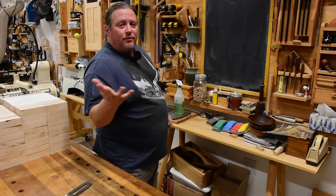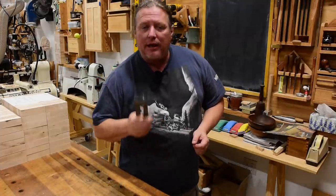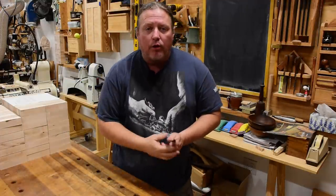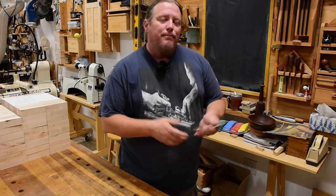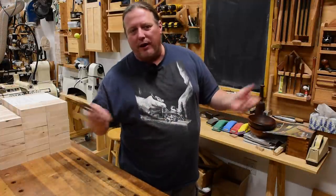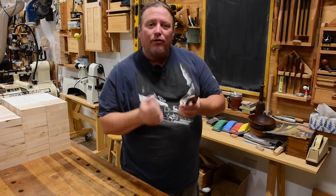So we've now covered my reasoning why I believe adding a camber to your bench plane blades really is a cure-all for at least all the frustrations I was having with hand planes. It's not that hard to do — be it extreme camber, which you first create on a grinder, or something you just do on the sharpening stones over time. In my opinion, it really is a cure-all for a lot of hand plane woes. I hope you enjoyed this and got a few tricks from this rerun, but in the end I always want you to remember that it's worth the effort to learn new stuff, create new things, and share it with others. Y'all be safe and have fun.